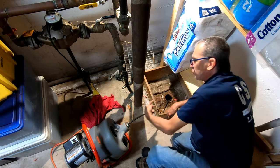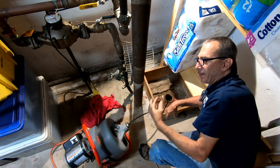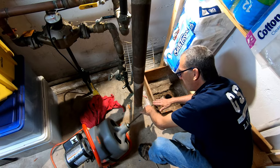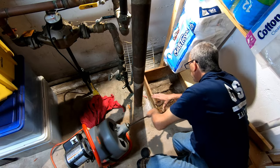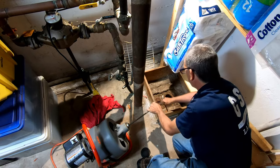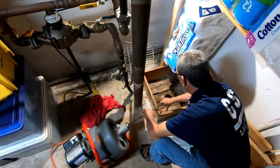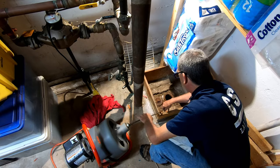What's happening now is it's spiraling inside the sewer line and you want to get that snake to push everything out. You should really have your hands on the snake loosely so you can guide it. You don't want this thing to whip back at you or grab you. I'm showing you some of the right and wrong ways of doing things — please make sure your hands are really on it and guiding it, turning it on and off as you go.